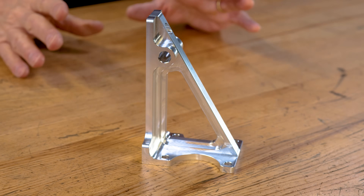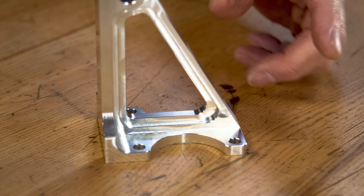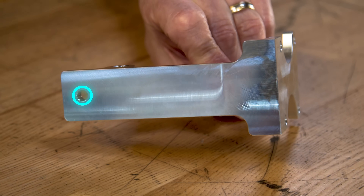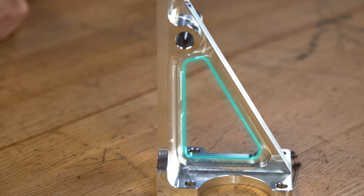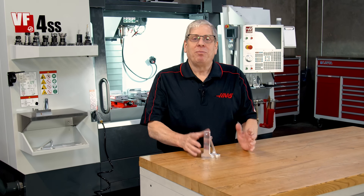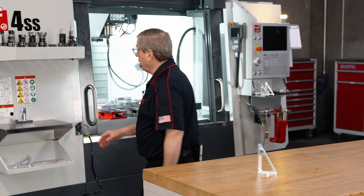Here's our part. It's a bracket with a 90 degree angle and then 30 and 60 degree angles. There are two flanges. The shorter side has four mounting holes and the longer side has one hole through with a counterbore for a socket head cap screw in the angled rib. The rib is pocketed through and there's a boss here to support the through hole. It doesn't look terribly complex, but when you think about how to make this on a 3-axis machine, there are actually five different machining operations.